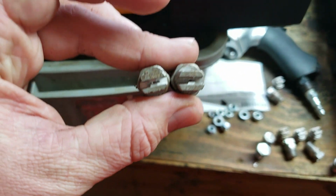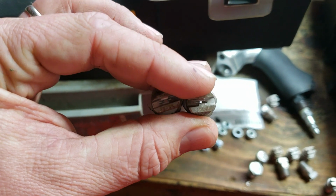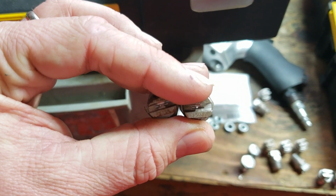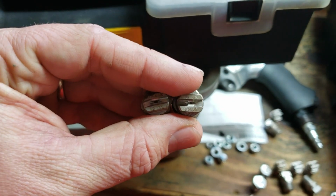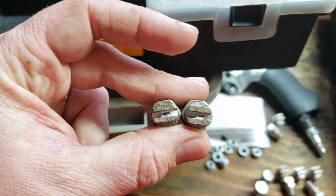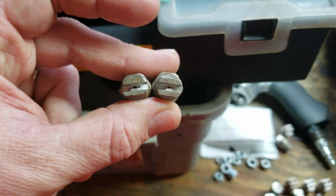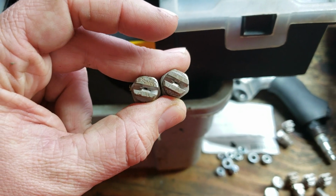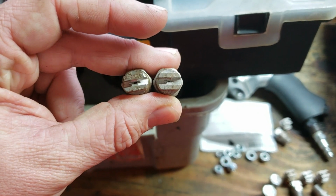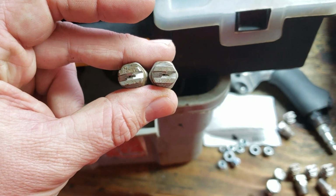And also the 25055, technically that would be for 11 gallons a minute. The 35s would be up to 14 gallons a minute. My goal with the surface cleaners is to bypass as little water as possible to maximize the flow and get as much cleaning power as we can out of it. It's always worked well for us. Our machines are 8 gallon a minute, 3,500 PSI. So if it drops down to 2,500 PSI or to 2,000 PSI, but I'm getting every last bit of water through it, I'll take that every day.